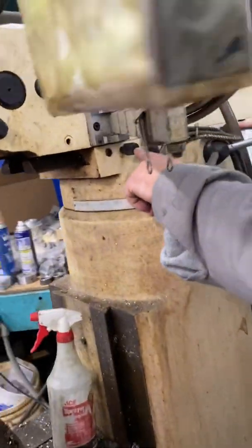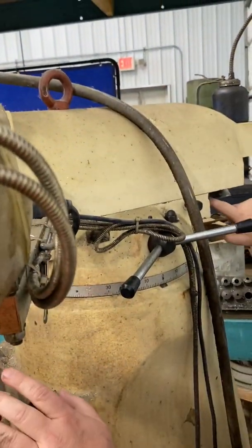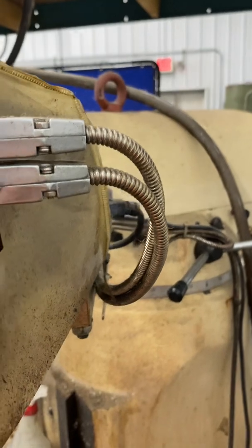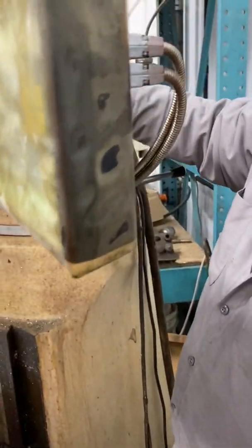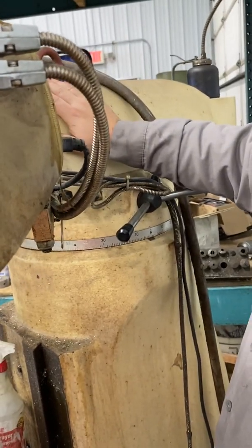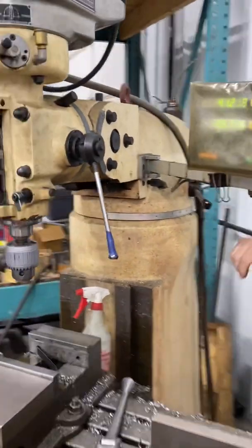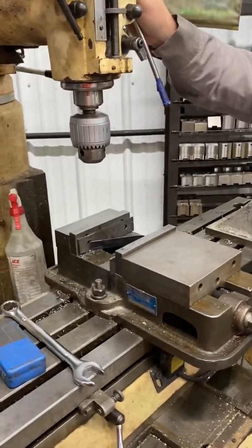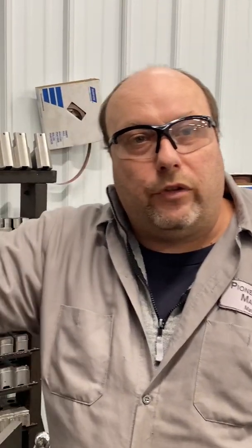I can loosen these two bolts and I can crank this — this whole thing rides on a track and will go way out beyond my vise or back. Just like if I wanted to swing it this way and that way, I can do combination angles with these things if I know how to use them. You're not going to compete with today's technology, but nevertheless there is a place for these things with certain jobs — we still use it today. When our full machine shop has machining centers and lathes, we'll introduce you to some of them in the future. But this is a great way to describe and display it. Now you understand a little bit more about manual mills. My name is Matt — thank you for watching CNC Machinists Made Easy.